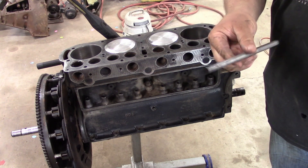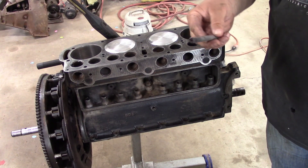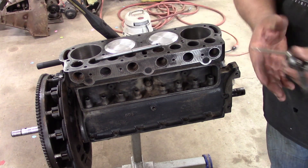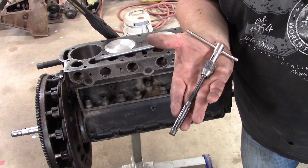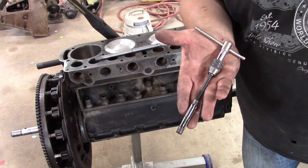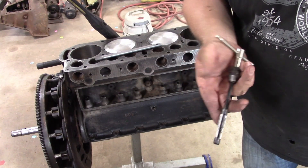When you do the valve seat grinding guide, this is a straight up 7-16ths. I have it oversized as well. I have a very small adjustable hand reamer — it came from Shars. I've got a little set of them in a wooden box. I have adjusted that to about a thousandth over 7-16ths.